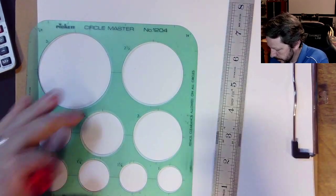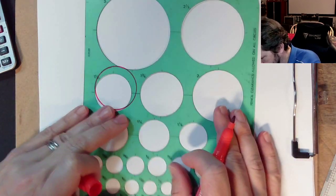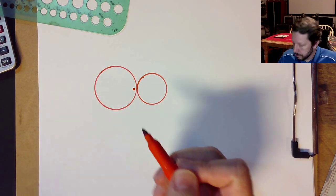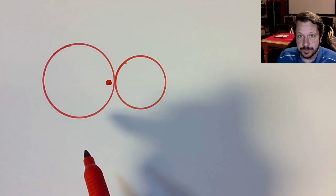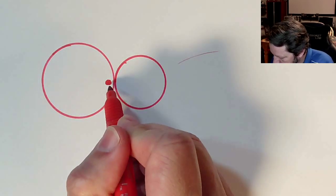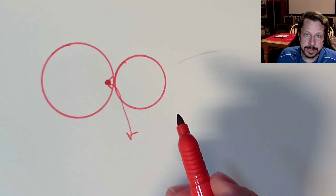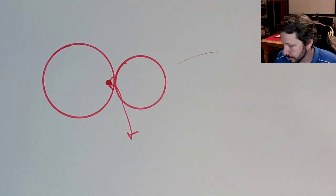What happens is related to contact stresses. When you have a contact stress — let's say these are round cylinders in contact with one another — when they push together, there's a higher stress beneath the surface. Over time, as these things spin around and make contact, it's possible that this little area ejects, leaving you with a pit in the surface. In this case it's gear teeth making contact over and over, and remember there's no endurance limit for contact fatigue.